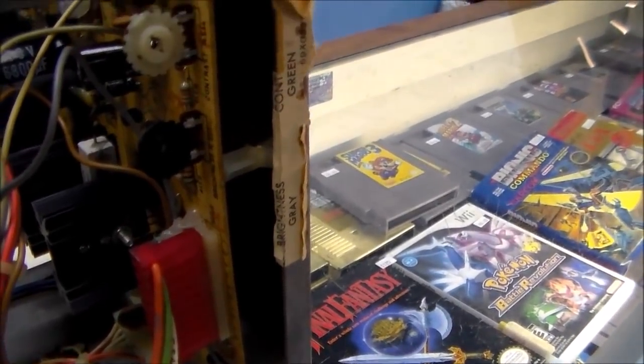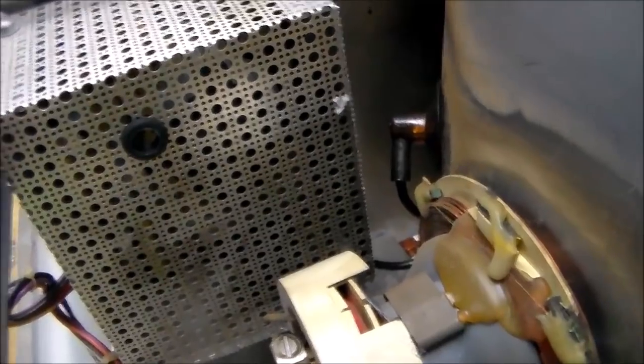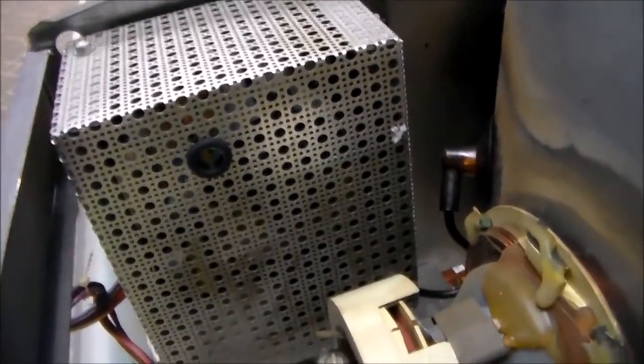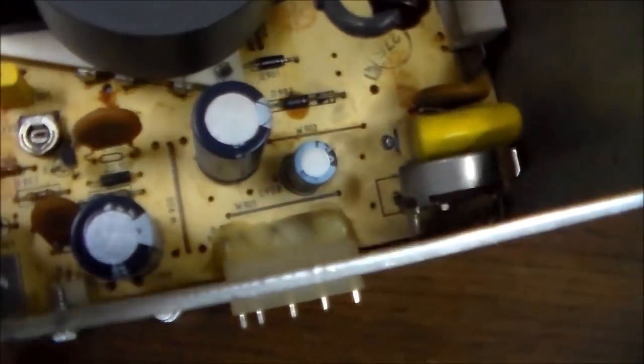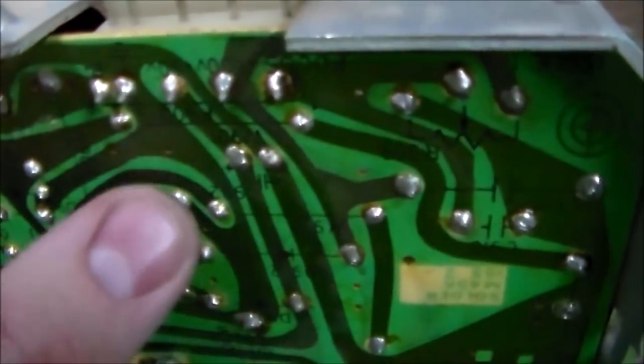Let's look at the back of it. On this side we've got the deflection board, and you can see all the new caps — somebody has reworked it. It looks like they've even put a new brightness knob on it maybe, so that all looks good. They even replaced the big filter caps, probably trying to figure out why it's blooming. The high voltage unit is over here and looking inside it looks like they've replaced those caps too, but with it being too big that's usually a voltage thing, so I'm going to take that out and look at it.